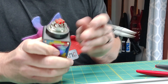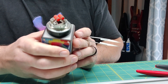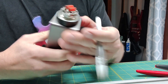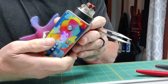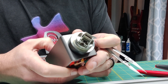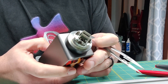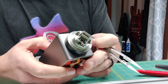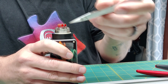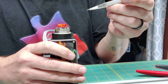Short pulses — not cherry red, not white hot, just short pulses. At this point we're up to 115 watts, still registering 0.18, but I know that build is likely pretty much balanced at this point. I'm going to take a guess and say 0.38. No — 0.34. Not a big deal. A 5mm would have been 0.37, 0.38, so these will probably settle right at 0.34.